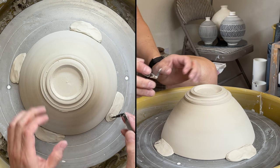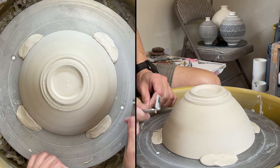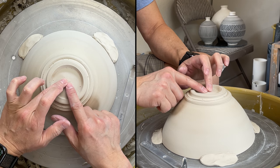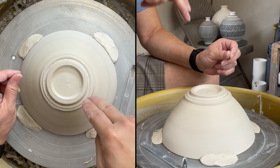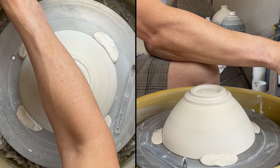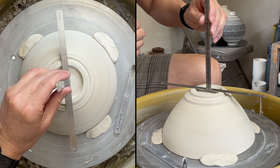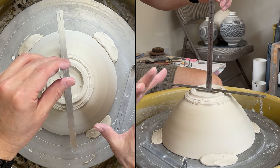This is the third cut. We already checked that the bottom thickness is 15mm. I want to make sure this part is within three millimeters, meaning I could go 12mm deep. Bringing back my ruler — now I have about seven, so I have five more to go. Now I have about two.